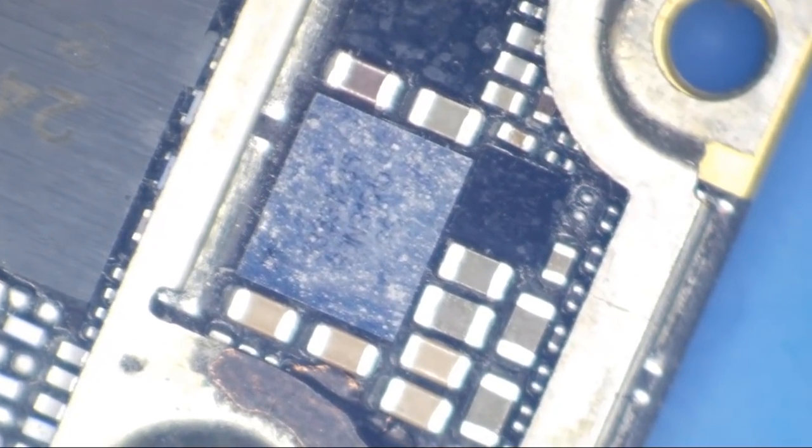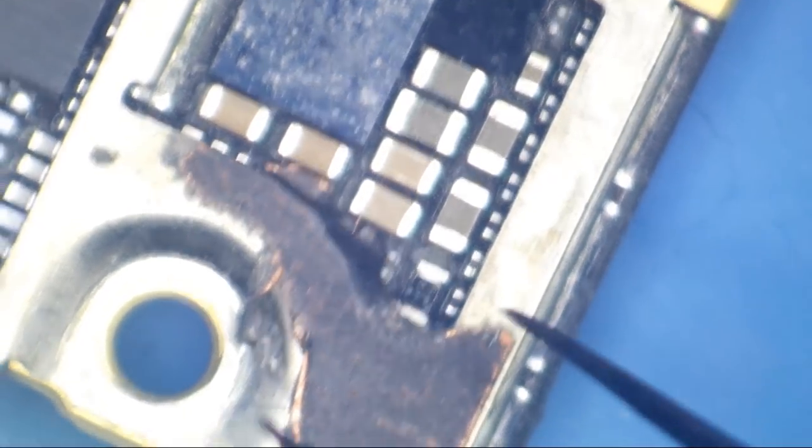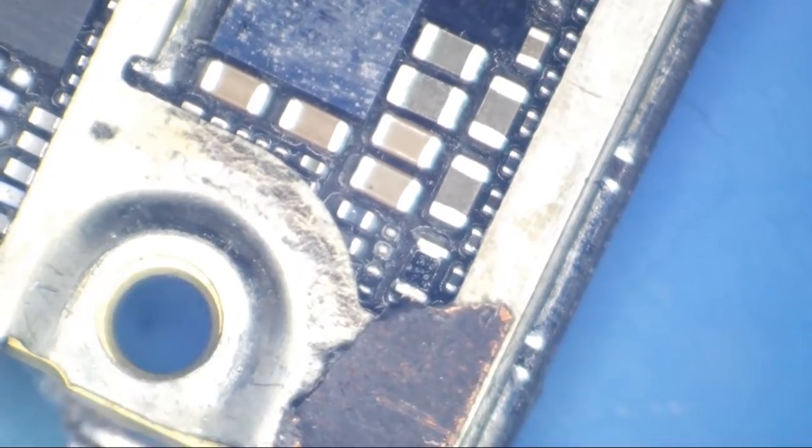Okay, so like many prior rework attempts, this one is not giving me a good feeling, but this down here gives us a no-brainer type situation where we've got this conductive sticker that's been pushed down here up against these caps. I have gotten lucky on these before where they just looked hopeless and wound up being something as simple as pulling back a piece of metal off of ground like that. I mean, that does happen. I don't have a real good feeling about this one. This one looks really, really bad.